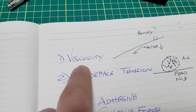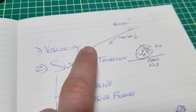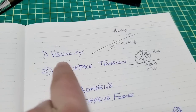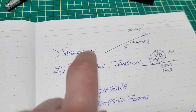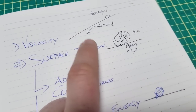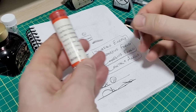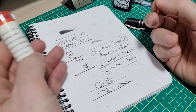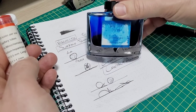On the flip side, wood glue has fairly high viscosity — doesn't flow quickly — yet its surface tension is very low, because you want that glue to penetrate into the wood. So we have to be careful not to conflate these terms and assume that if viscosity is low, surface tension is also low. This is why measuring surface tension of ink would be the most valuable thing, because we are really concerned about how well that ink will wet another surface.